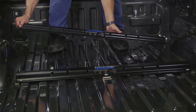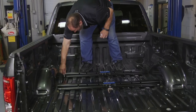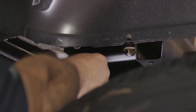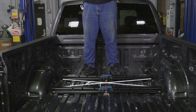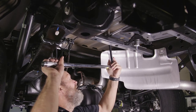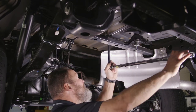After all drilling is complete, move the rail back into position and install it using the stacked U-shaped spacers, galvanic isolator squares, and 1/2 inch fastening hardware. Make one final check using diagonal measurements to ensure that the rails are square to one another. You are now ready to tighten all hardware to final torque specification as indicated in the installation manual.